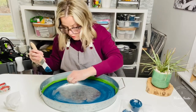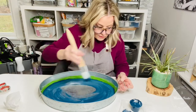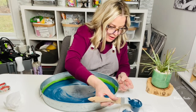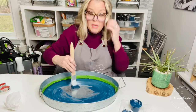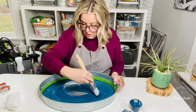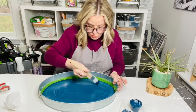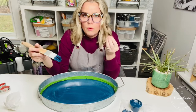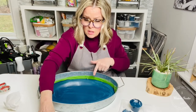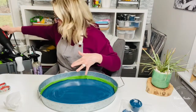For a surface like this metal tray, you just want to remove any surfactants — dust or anything on there — before you start, and the paint will adhere. For wood, 'no sanding' means no sanding, priming, or stripping, even if it already has stain. Just make sure to remove any oils or old liquid polish. We do have a furniture cleaner product for that. For this tray, I just went over it with a damp rag, made sure it was dry.